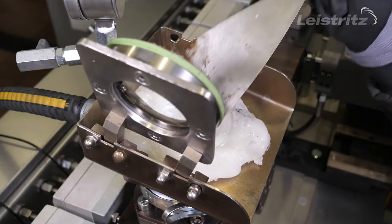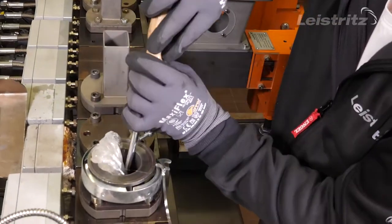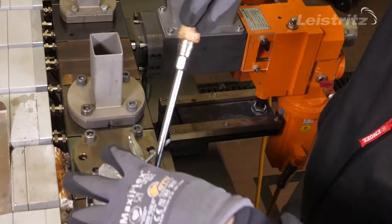If the operator is not reacting fast enough, the material can freeze, blocks the vacuum dome, and then it means you have to stop the extruder once and clean it. And every time you have to clean it, there is a risk of accident for the operator.